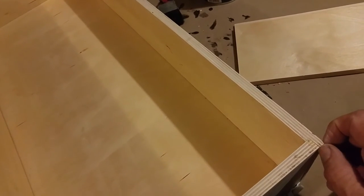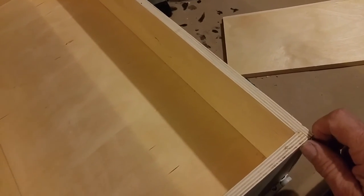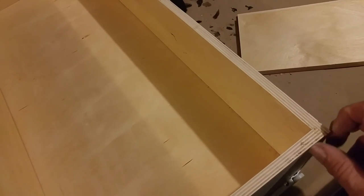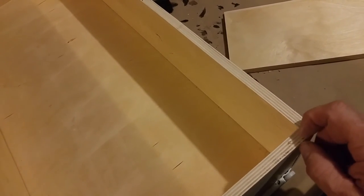One of the things I found is I was going to do a dado and rabbet, but when I glued the test sample it actually chipped out the rabbet — because there's just not enough space for the rabbet and the plywood is a bit brittle, it wants to chip out. So having a simple dado makes it strong without that weakness. As for the bottom, because it's recessed in — even if I had used quarter inch and suspended it so it's more of a hollow bottom, you would still be using up a half inch of space. So it didn't cost me anything in space or wood, and you also won't have any weakness.